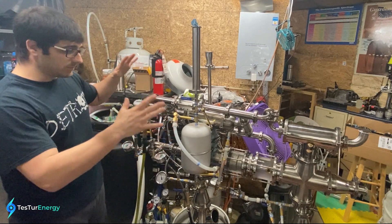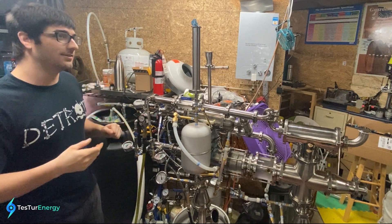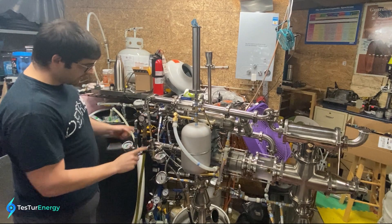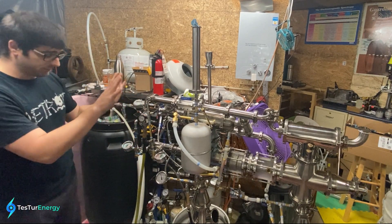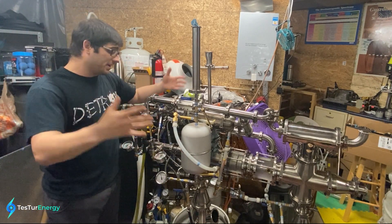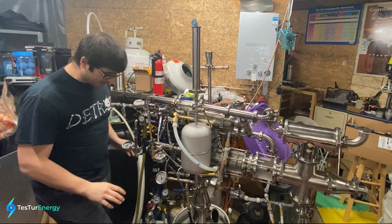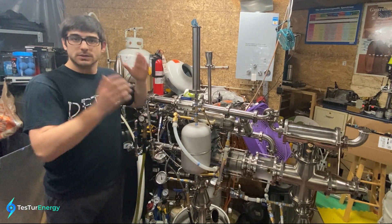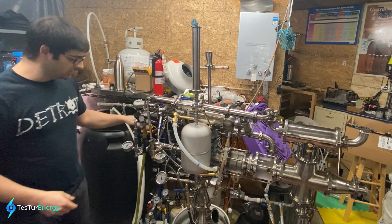So let's continue right now. I'm going to be doing some liquid fuel tests here — this is the first liquid fuel test we've done. This is pretty loud; there are a lot of detonations going on right now, so mind your volume. This is an aluminum gas tank with a sight glass for the fuel height. This is air, this is the fuel. Right now I have it set up to do propane and liquid fuels at the same time, but it is currently set to only do liquid fuels because I want to hone it in. Gaseous fuels are super easy — if you want to run on wood gas, this is good to go. We are all set with gaseous-type fuels; I've got propane compressed, and you don't even need to have it compressed because you can draw it in with the venturi air. So I'm just trying to hone this in for liquid fuels here.